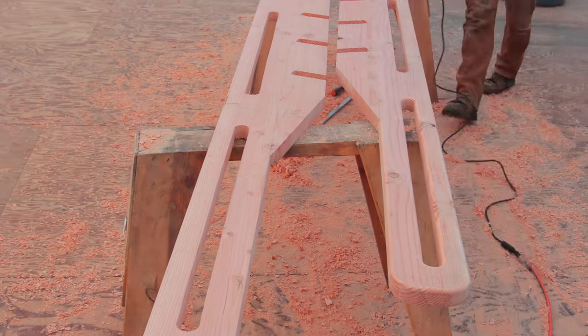These are the best screws on the market — quarter-by-fours from Screw Products. A couple of these per stair tread and this whole thing is going to come together. These are four inches, pretty big — we definitely want to pre-drill for these. One way, without having to scribe everything out on the other side, is just to screw from the inside, get exactly where I want it, and then when we put it all together, I'll screw again.